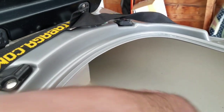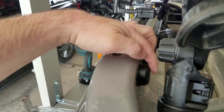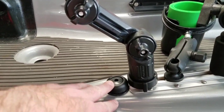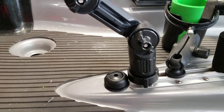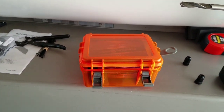You can see in here — that white piece — that's the bottom of the first hatch that has the removable liner. There's just enough room for the battery box and then there's another liner that goes in this hatch. So it'll be completely out of the way, it'll be pretty awesome. For the transducer I've got this guy right here where the wires will go into the hull. I used the Wilderness Systems through-hull wiring kit. I know Hobie makes a good one too. Same thing here, a waterproof tight connector where the fish finder transducer and power will run through. I'm going to switch that out to a two-wire plug — should be a nice clean install.